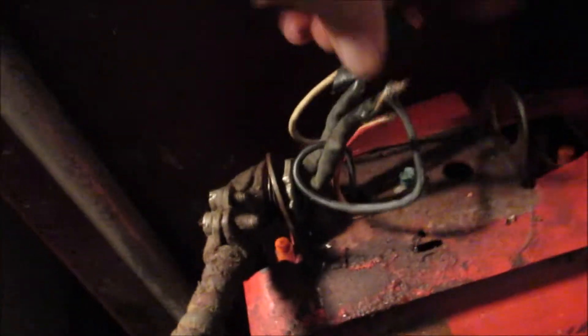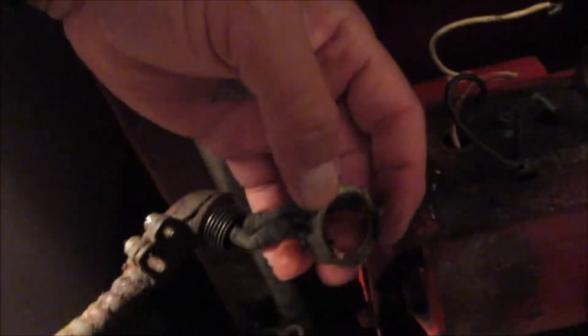With the power off, I just hit this with my hand and a screwdriver to get it spinning the opposite way to loosen it up. See — you loosen this up and then you can take the wires off. The breaker is already off so you don't have to worry. There's a screw in here for the ground, but this one only has two wires — no ground on this one. This house is from 1910. I'm taking these wires off right here and they come right back through, then I'll put the cover back on so I don't lose it.